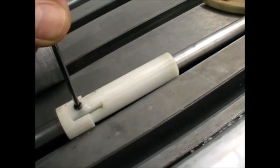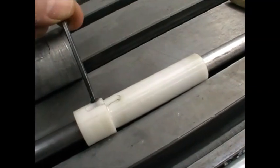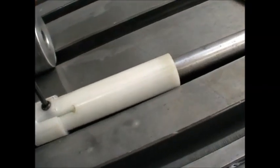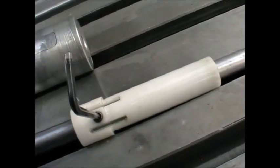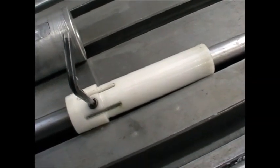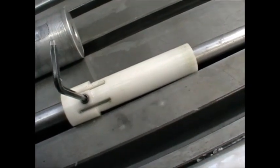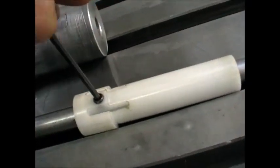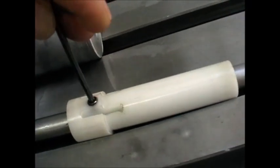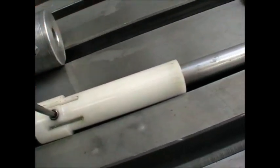So it's a very quick, simple way to make a spindle stop bush if you don't have a threaded hole in the end — just a headed part with a couple of slots and a grub screw in the middle. If it were aluminium you'd need to cut the slots around three sides and just have it pivoting, which would probably be slightly better. I made a quick one out of acetal to get me out of a hole and it worked really well.